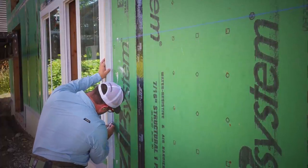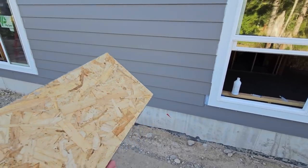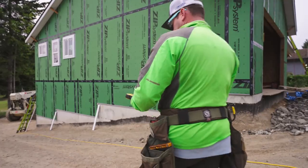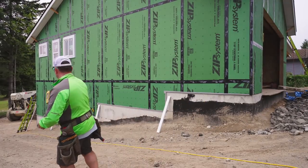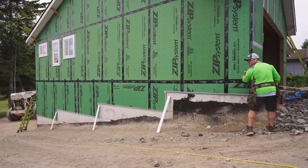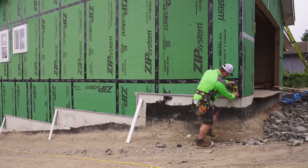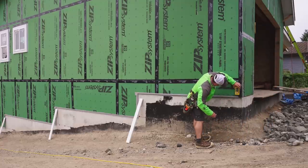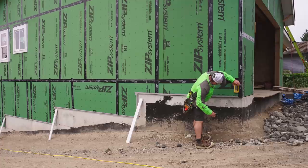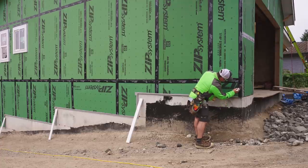These are all top marks we're making. With LP siding and fiber cement siding they're so consistent that if we snap lines and make the top straight, the bottom will be straight as well. In the old days with cedar we didn't trust that, so we made gauges because you wanted course-to-course to be consistent — the boards weren't always exactly the same. But the SmartSide comes out exactly seven and seven-eighths every time.